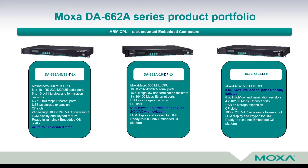All variants share four independent LAN networks with independent MAC addresses, USB as storage expansion, and a CFast slot as well. Wide power input range, as mentioned. And an LCM display, which is the human-machine interface on this computer, allowing the device to be configured externally over the buttons — meaning IP address, subnet mask, and other basic network parameters.